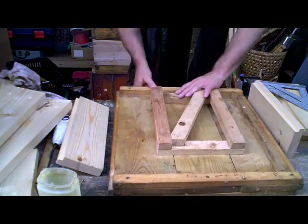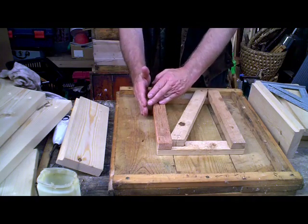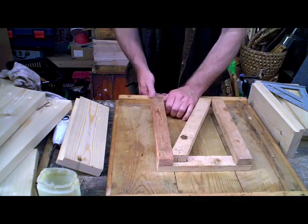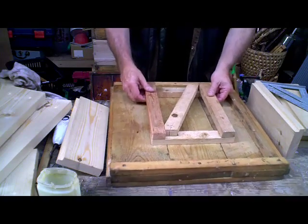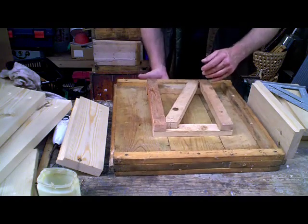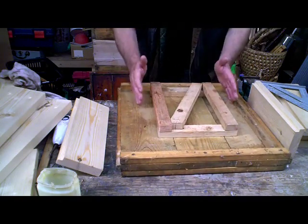If you try to do that on the bench and you are drilling or screwing into the end sections of your hive, if you push a driver hard it is going to push the whole thing and then things are going to wobble and maybe move apart. So stabilize your jig by having a lip. It might even be better to have a lip just on one side to keep it flat, but that doesn't matter with this one because it holds the timber quite firmly.